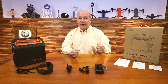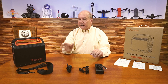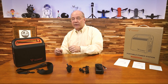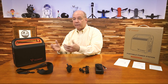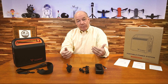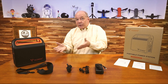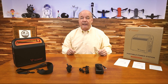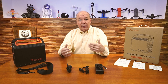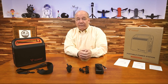But if you're just heading out for a day in the field and you want to charge your tablet, your phone, your drone batteries, your camera, you need something a little bit smaller like this. Because to double the capacity of a power station, you've got to double the number of batteries, which essentially doubles the weight. If you're taking a 500 watt hour unit out and you're bringing it home after a day with 50% charge still left, you've carried a lot more weight than you need. So 300 watt hours is right in that Goldilocks zone — perfect for a day out in the field, and you'll still have capacity left when you come home.